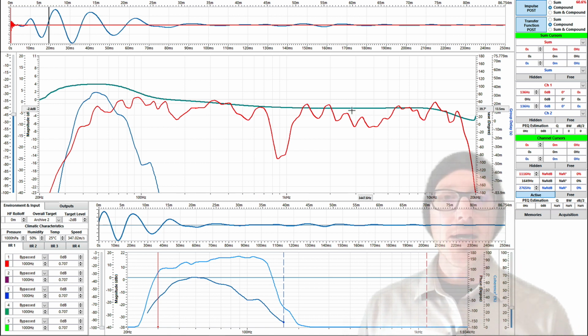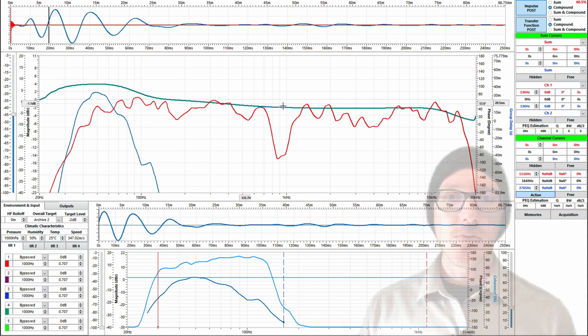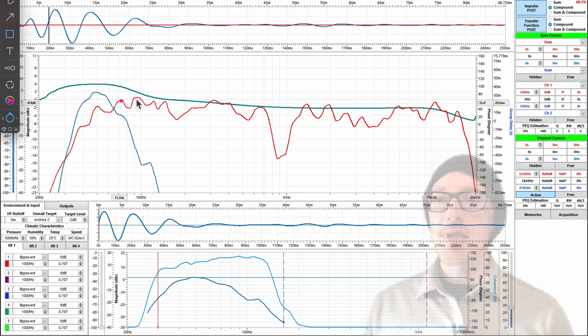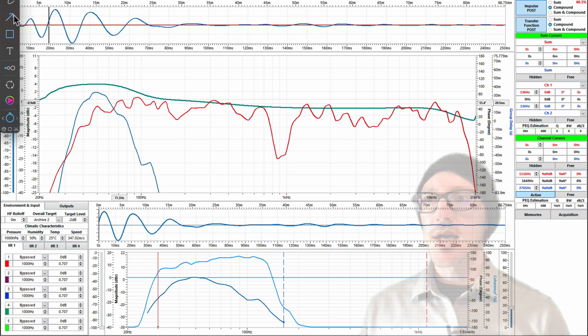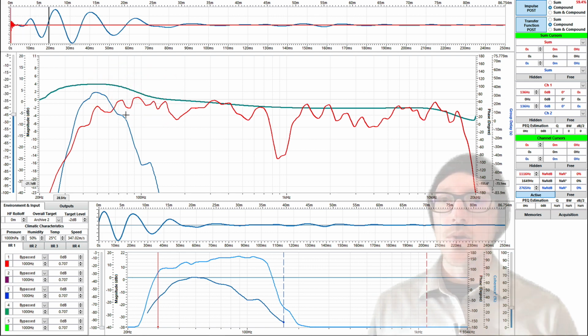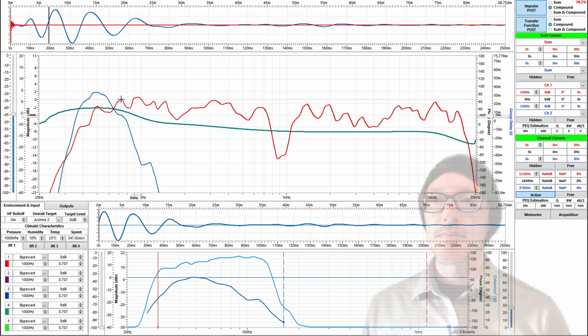So I've got my target here set so that it is basically matching my main through the mids here. So how do I set the level so that when I turn main and sub on together, they will sum and make a really nice summation that hits my target like this, right? So I'm hoping that where they're matched, they'll go up like this and hit the target. One way you might do this is, once you're matched here with one of your traces, you can offset your target by 6 dB, and now find where main and sub match.